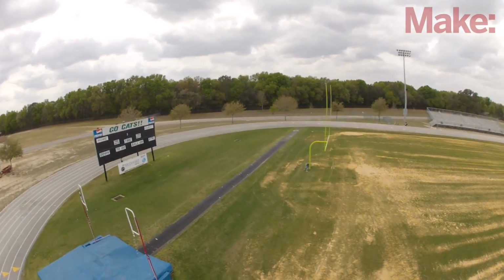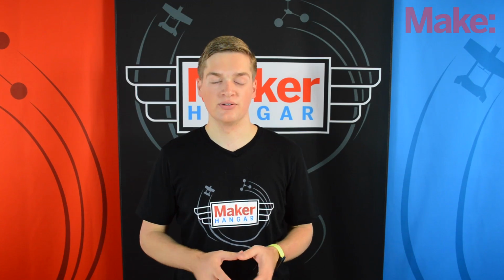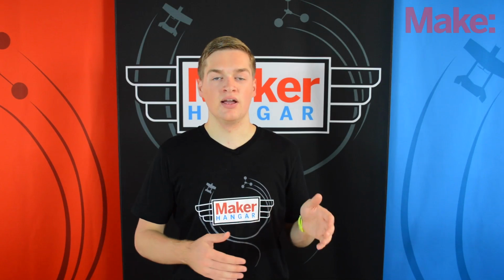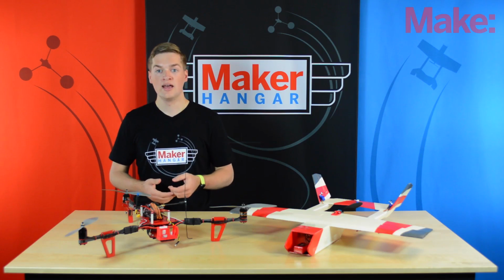With a quadcopter, the controller board has to figure out the precise rotation for each of the motors to create the proper torque imbalance to yaw the aircraft. Because this is controlled by the controller board, you can get very robotic movements. So if you yaw and then let go of the stick, the aircraft will stop abruptly. For video work, this makes it very noticeable that it's a quadcopter or other aerial vehicle and can be distracting